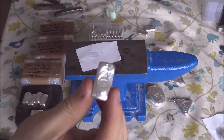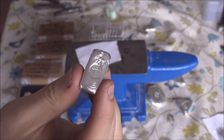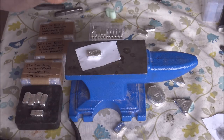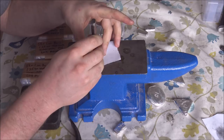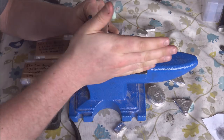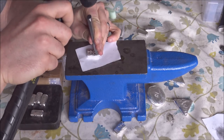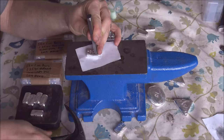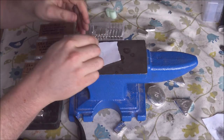There it is — nice and deep. You can see I didn't even give you a warning. It's all about confidence and going in quickly and strongly, holding that stamp really steady. The last stamp we put on is the 2019, which goes underneath. We're working from the top away from ourselves so we can position it precisely. This one bounces sometimes so I do one hit first, then angle it to hit the particular part of the stamp that needs more depth — the nine side — and there we have the 2019 all done, looking pretty good.